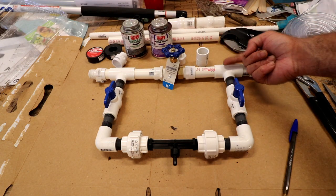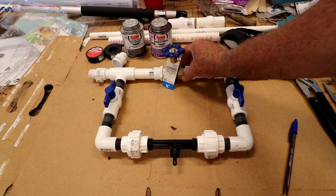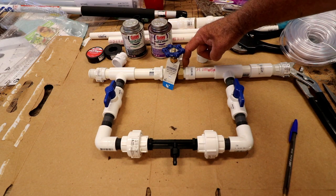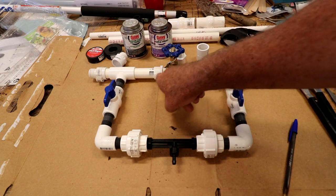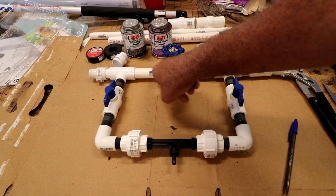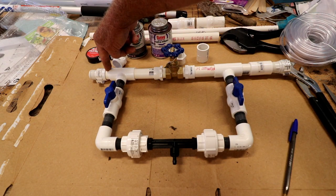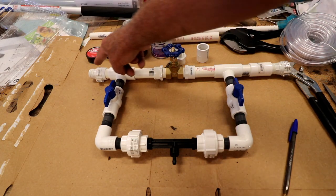Coming back over here, this is a slip to a three-quarter inch pipe, to a slip to a gate valve. This is a slip female to threaded male, three-quarter inch, to a gate valve that has two female threaded threads. Then you go to a male three-quarter inch thread into the female brass gate valve, to a slip, to a three-quarter inch pipe, to the male end of a hose connector. That'll be the male end that hooks up to the rest of the irrigation.